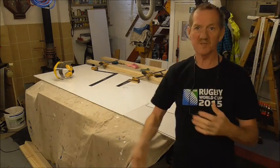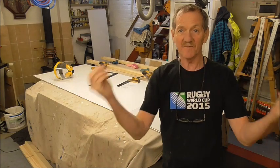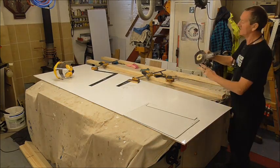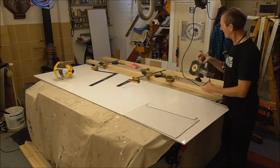Then when you want to, say for instance you're making a cabinet with it and you bond it to a cabinet, clean off the edges, you can do the same way as you do any other Formica by using the router with a trimming bit, and that does it nicely.